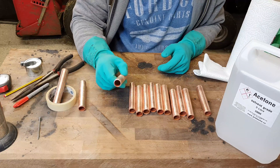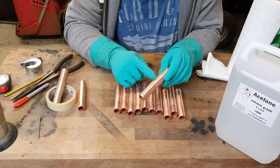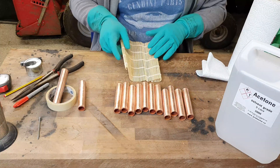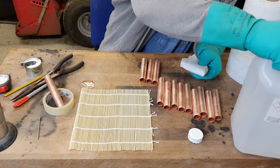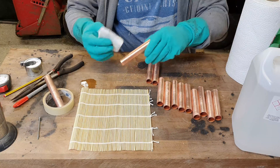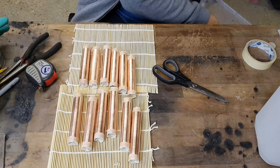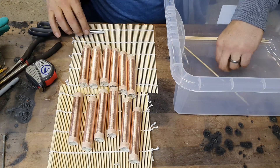All of these have been sanded with 220 grit, which should have gotten rid of all the coating. I'm also hoping the 220 grit scratch marks will help the patina adhere to the copper. Once I've cleaned them I'll lay them on these holders and then I won't touch them again so I don't get grease from my fingers on the copper. Now they've all been cleaned. A little bit of tape over the ends just so I can pick them up and handle them. Next job is to run some holes in the plastic and thread these through.